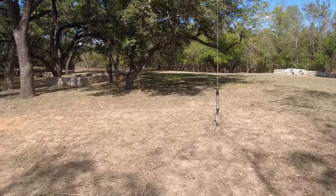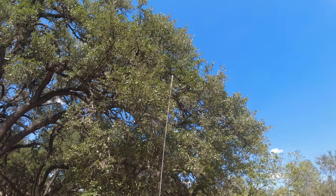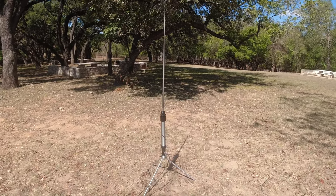I improvised — I'd moved the coil all the way up and it was dipping around 20.6 MHz, still too long for 15 meters. So I took the telescoping whip off my MFJ antenna — one I've used on two or three dozen activations — put that on there and shortened it down shorter than the military mast that comes with it. It's dipping at 21.2, still about 1.8 or 1.9:1. I think the soil out here is just way too dry. Lesson learned: if I was going to purchase this antenna, I would want the telescoping whip, because it lets you make it even shorter and go down to 10 meters. Made 29-30 contacts on 20 meters — no problem. Worked great.